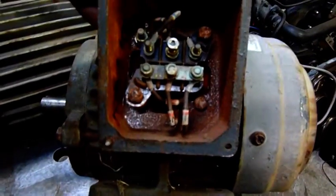I'm guessing it's this one because it's had water through the windings — the whole terminal box and stator has been flooded with rain water. Whereas this one's spotless and it's also a 2 horsepower. This is a 1 horsepower, this is a 2 horsepower.